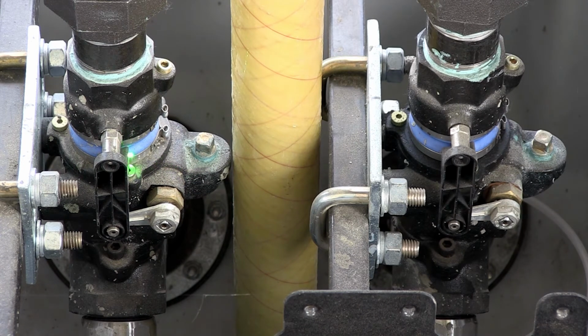To test the shear valve, what you'll want to do is actually be pumping fuel either into a gas can or an automobile, and you want to trip the shear valve and make sure that it actually shuts the flow off wherever you're delivering the fuel, either into your gas can or your automobile. The way to do that is just by tripping this shear valve arm, this trip arm here. When you do that, it should shut off the flow. If it doesn't, you need to have the shear valve repaired.